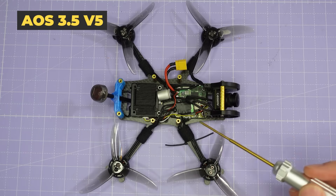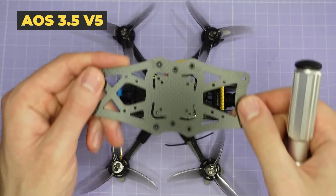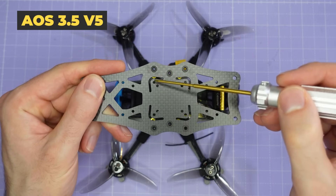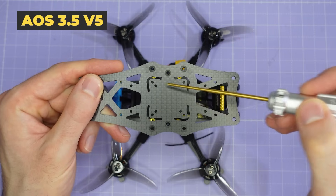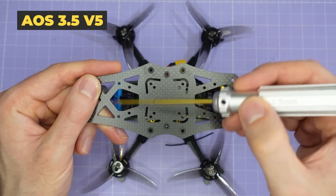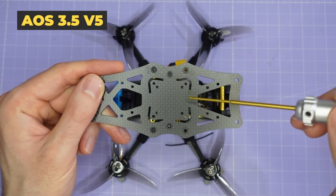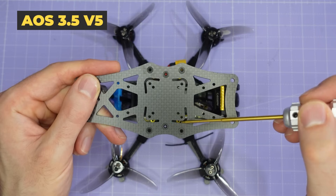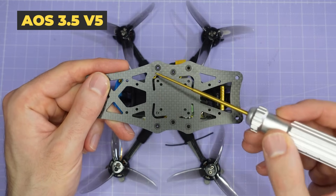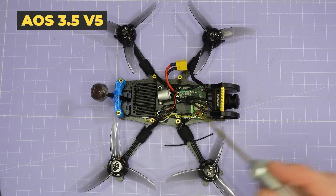Now that the top plate is off you can see a different electronics mounting configuration compared to the AOS 5 — the flight controller is mounted up front with the VTX behind. In the middle is the AOS XL, and you could choose to mount your flight controller in the middle on either 25 by 25 or 20 by 20 M2 mounting. Alternatively you can mount the flight controller in the front or rear on 25 by 25 or 20 by 20. No matter where you mount your electronics, you always get the benefit of the XL technology because the flight controller is always separated from the main source of vibration, which is the root of the arm. For ease of build we've got press nut reinforcement for the arm mounting screws and the aluminium camera cage stays completely rigid even once the top plate is off.